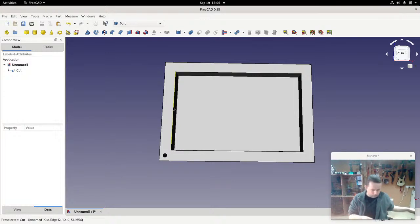And where did I put the ruler? 3mm refers to the size of the bulb itself, not the base. The base is very slightly bigger, but you can actually shave the base if you want. But knowing that it's 3mm is useful, because that lets you make a hole in this which is exactly 3mm in size. Now, when I'm putting this in through the side of the wall, there is something important. Oops, I've lost my LED. There it is.